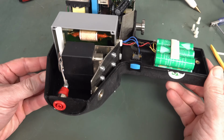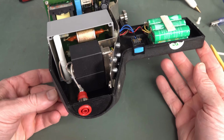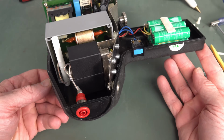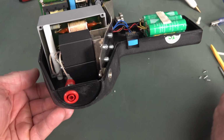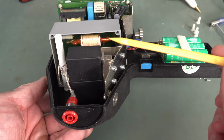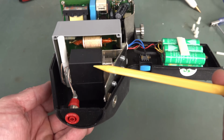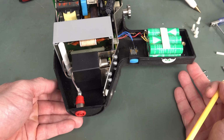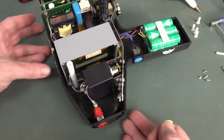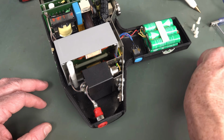One of the main things in this is, well, you're going to have a big storage capacitor, so it'll be 150 picofarads or whatever standard storage capacity you have. And, oh, look, yeah, there we go. That's what I expected it to be, all potted away. And there's the custom high-voltage relay in there. In fact, they've got a couple of them, because this one can actually do positive and negative polarity, so it's got to actually flip the polarity in the thing.